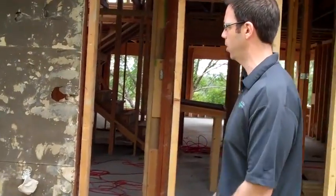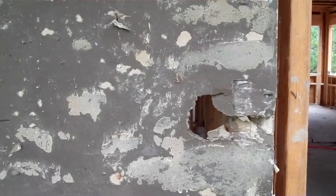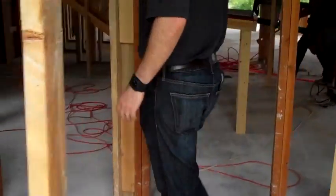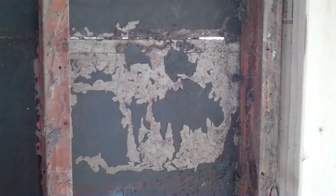You don't see gypsum sheathing a whole lot in residential houses anymore. But if you look, there are a bunch of holes in this gypsum sheathing — that's actually where termites were coming in and eating quite a bit of the sheathing. That paper face on the sheathing was getting a lot of termite damage. Let me step through this cavity and show you a little bit of the termite damage on the inside. Particularly concentrated in this area, you can see muddy areas — those are termite tunnels, and those are termites eating that paper.